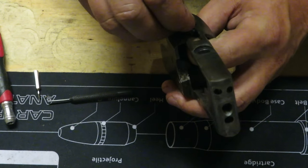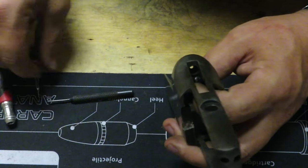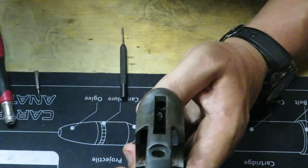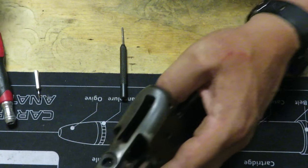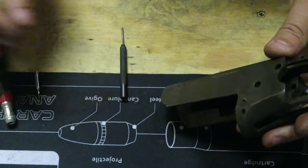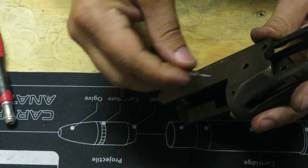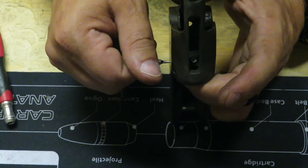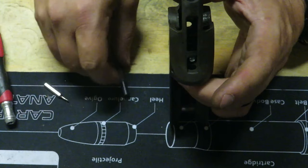The 410 goes in the bottom hole — get that lined up, drop that in there. You can see how that flat end is facing the retention hole. Take the longer screw because the longer one is the 410, and put that into the bottom. Using our screwdriver, go ahead and send that in — making sure it gives enough retention but not enough to impede its ability to go up and down.